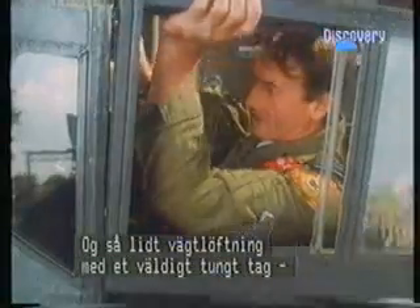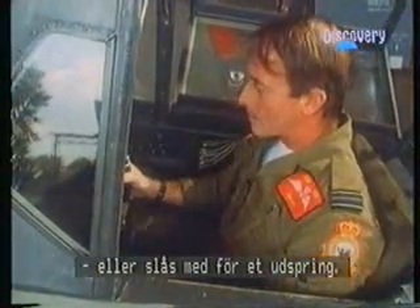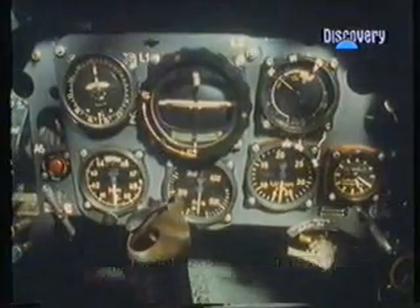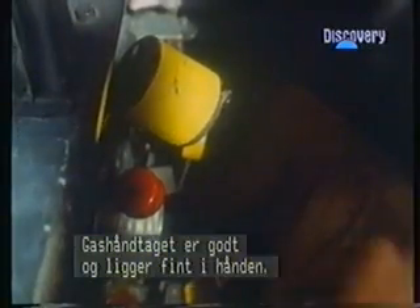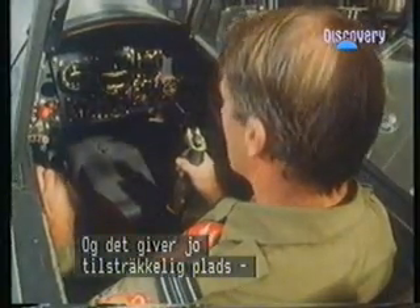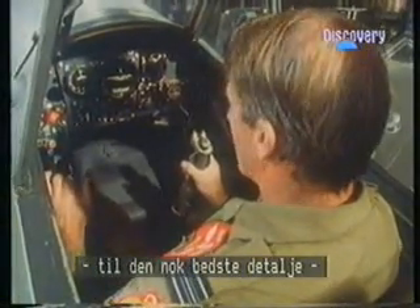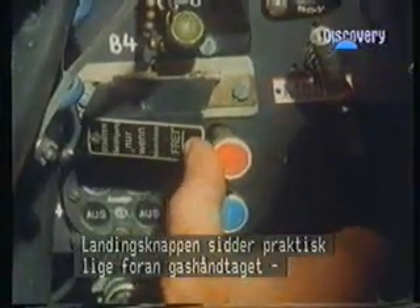Let's do a bit more weight lifting on what is actually a very heavy canopy, which I wouldn't care to have drop on my head or wrestle with in a bail-out situation. To be fair to the aeroplane, there are some features in the cockpit which I actually like. Starting on the left, the elevator trim wheel is perhaps a bit too big, but nicely positioned and business-like. The throttle quadrant is nice, throttle friction is nice — it's all business-like and well to hand. That allows sufficient space for what is perhaps the best comparative feature cockpit-wise between the 109 and the Spitfire, in that the undercarriage controls are nicely to hand just in front of the throttle controls and do not require that one changes hands immediately after take-off.